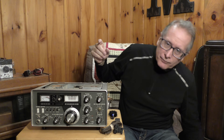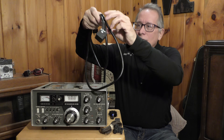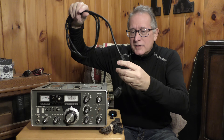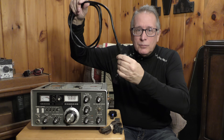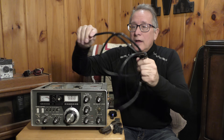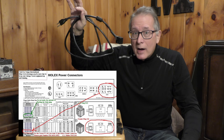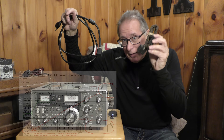Here's what you should do. We have a right-angle Jones, and we have a ferrite bead on the cord — that's to protect the transceiver from getting into other things in your house. And this is a nice number 14 three-wire cord, a proper cord. That's where you want to go — you want a nice cord for your transceiver, not a crusty lamp cord.